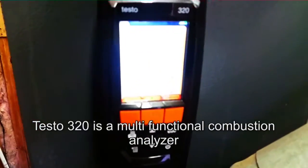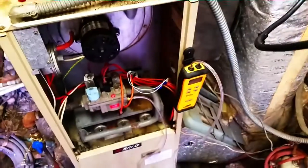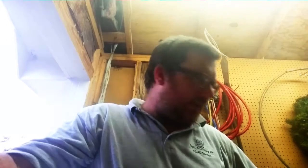I haven't started it yet. Manometer is set up. We're going to turn everything on and get things going so we can see how everything looks. The propane gas valve conversion says 11 inches of water column is their guide. We're going to let it run for a few minutes and see if we're still running high on oxygen. Right now we're at 10% — we'll let it level out over about 10 to 15 minutes and see where we end up as far as temperature spread before we go adjusting the valve up any farther.